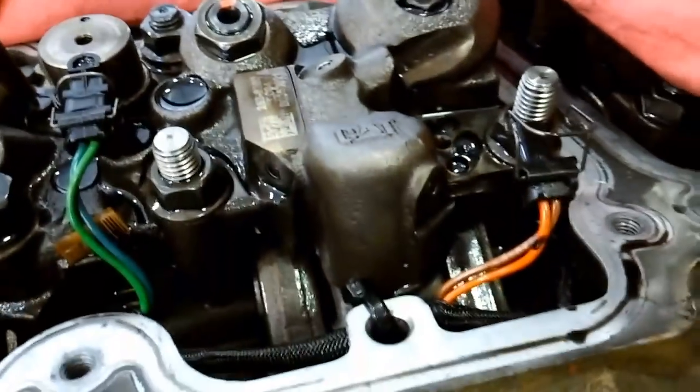After you loosen all the bolts, the whole solenoid comes up, but be careful because it is segmented. You're going to need a six and a 10, but those are Torx Plus — CAT actually doesn't use Torx on any of their truck engines. If you put a normal Torx in a Torx Plus, it's going to fit loosely. A Torx Plus 10 is slightly bigger than a normal Torx 10, same with the six. The six is hard to find because it's so small.